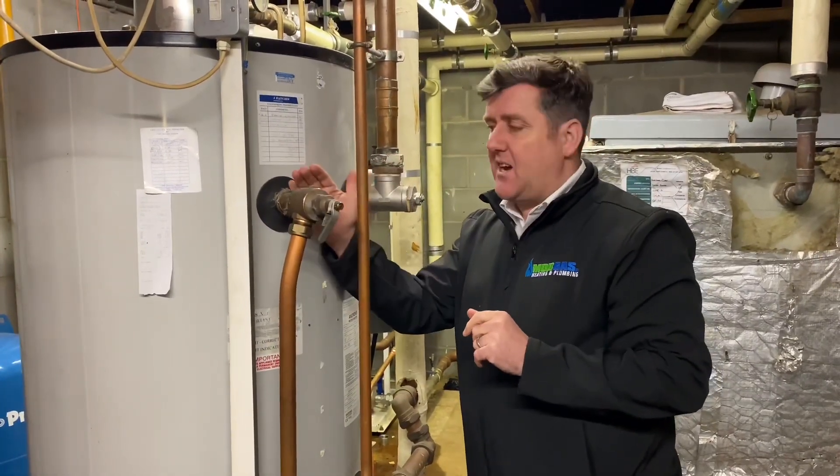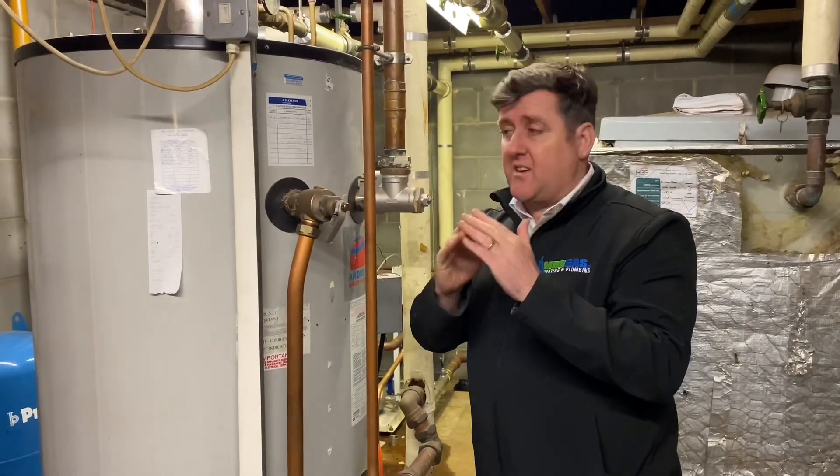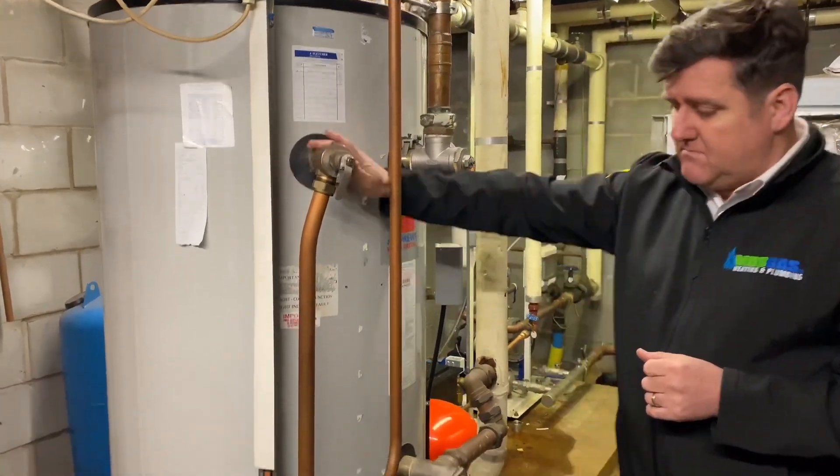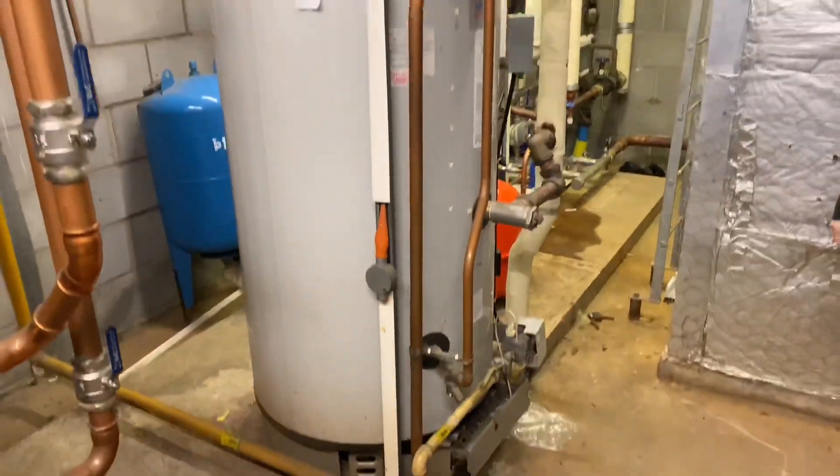So what's this valve here doing? This is known as a TNP valve — Temperature and Pressure relief valve. If you look at the data badge, it will be set at 80 degrees, so it will blow off at 90 degrees, and it will have a pressure of seven bar. Whichever becomes greater, it will dump. Inside there is a small probe that takes the temperature; the pressure side is just on a normal spring as you would on a domestic side. The probe does the temperature one — quite bulletproof really, doesn't tend to go very often, but it's expensive.